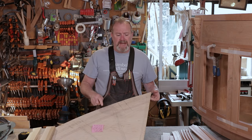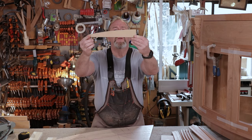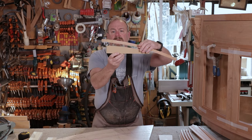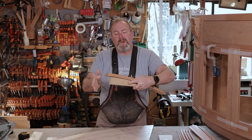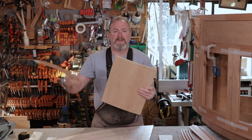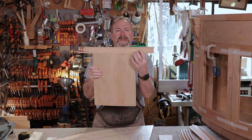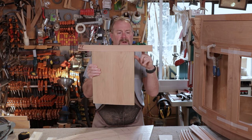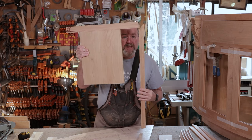I use this jig right here to make this little guy right here. You take this, and you put your molding on like yay. You put it on the chop saw over there and you cut a miter. Boop. You have to take these and miter these on top of that after we get rid of this little shoulder. And miter all the pieces like yay. See all that?